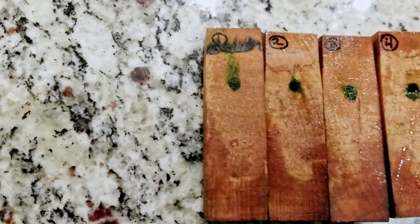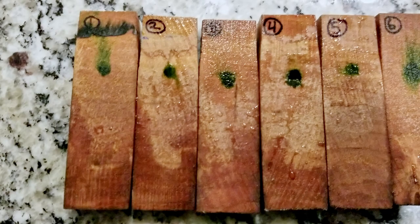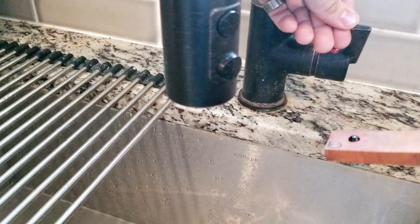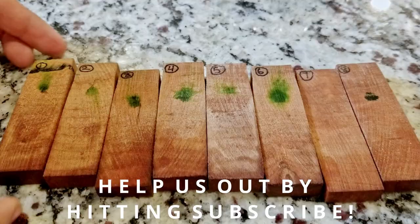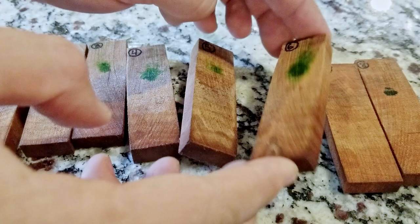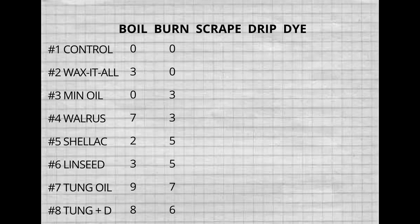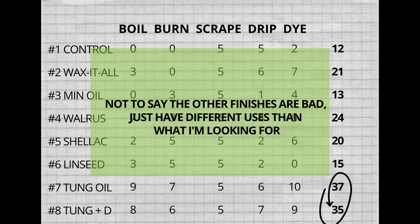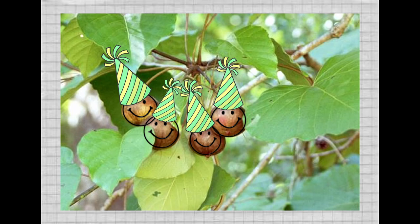We have one more final torture test — the food coloring test. I haven't seen anyone else do this test but the results really speak for themselves. The tung oil sample completely withstood this test — literally all of the food coloring washed away, unlike any of the other samples, and the finish is still there. A lot of the samples had the dye go through the entire wood since it's end grain. The walrus oil, shellac, and both tung oil samples were the only four where the dye didn't go all the way through. I made a tally across all tests scoring 0–10 each with a max of 50 — I gave everyone a 5 on the scrape test since it was inconclusive. Both tung oil samples clearly outshone the rest, with walrus oil coming in third and shellac close behind. Give it up to tung oil!